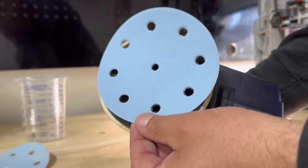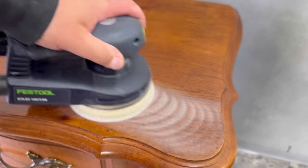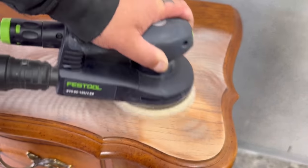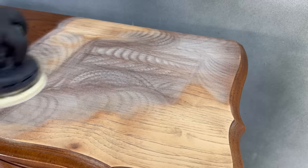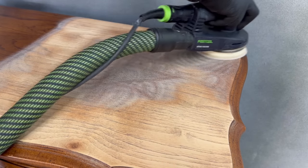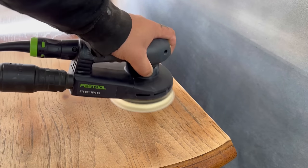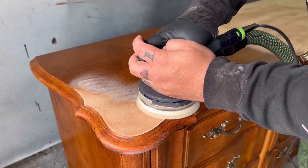This piece is going to be very similar to my last piece — all I'm doing differently is the color and maybe the treatment on the handles. I started with 150 grit sandpaper, but a lot of times with these French Provincial sets they have a really thick finish on top. It took a little time to get down to bare wood with 150, so I ended up switching to an 80 grit sandpaper, which does leave a lot of pigtails and scratches.